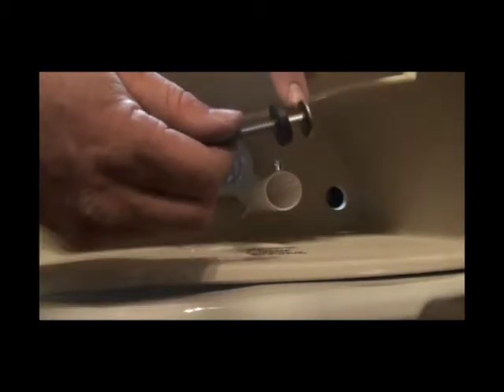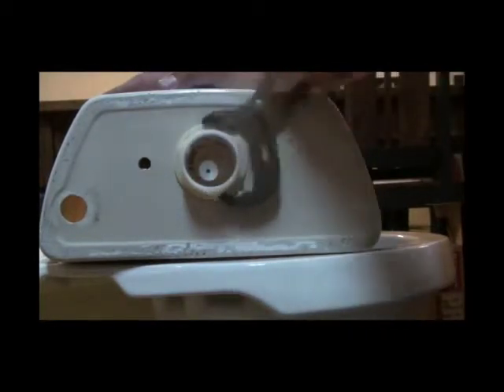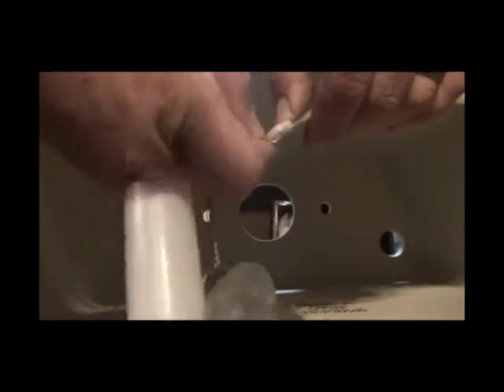Start the process of undoing — pull your bolts out. Due to the chlorine in the water, these rubber pieces are going to be very blackish and you're going to get your fingers pretty black. Notice there's no washer in between there — it's just a rubber washer going up to the bolt. Some of the instructions and kits say to put a washer there — don't do it, it will leak. That was your flush valve gasket — pull it off. Then this is your flush valve nut. You may have to use a giant pair of channel locks — it spins off this way and then you can remove your flush valve. Your flush valve is also attached to the flapper, which is attached to the handle. Now your tank is completely empty — use a rag and clean up any debris where you're going to reseal. Have that area dry.